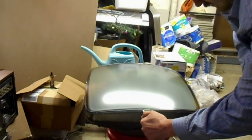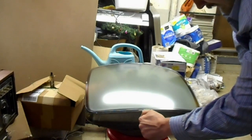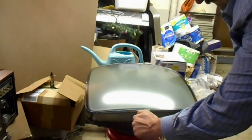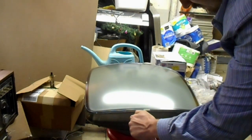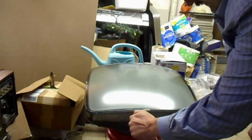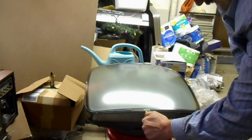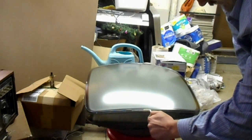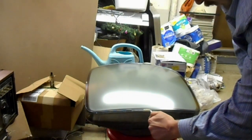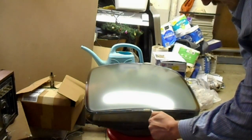Now what you want to do is force just a little bit of caulk into the gap between the CRT and the safety glass. You don't want to go in too far this way. You want to try to limit it to roughly a quarter inch max, and you don't need a ton of penetration as long as you're sealing. This caulk will hold the safety glass on in a more permanent capacity and will also seal out dust and foreign materials and contaminants that the static electricity of the high voltage that's applied to the CRT in operation pulls in to basically the CRT's outer surfaces, anything that air can get at.